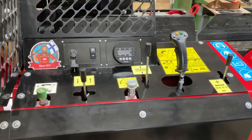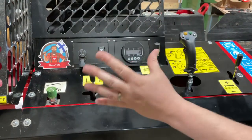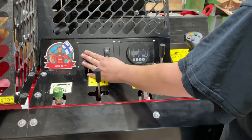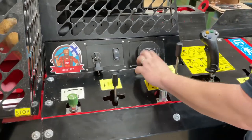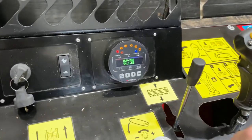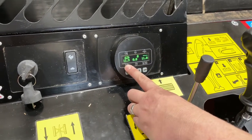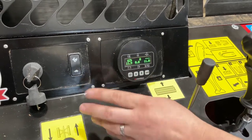When you look at the main panel here, this one is outfitted with the Honda IGX 800 V-twin engine. So our engine controls are all right here — the ignition switch, throttle control, and then we've got extra controls within this controller that show engine temperature, engine RPM, how many hours on the machine — in this case we've got 11 hours on — the battery is at 11.9 to 12 volts, and fuel consumption is at zero because we're not running it right now.